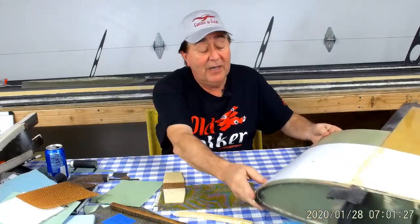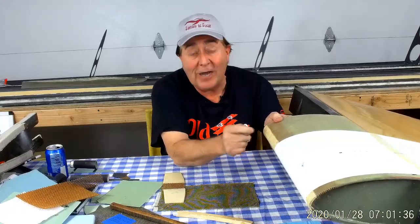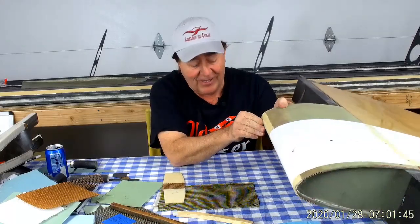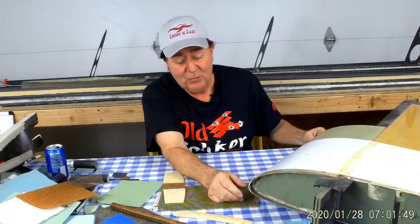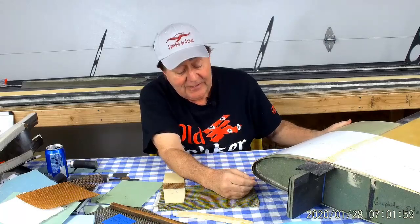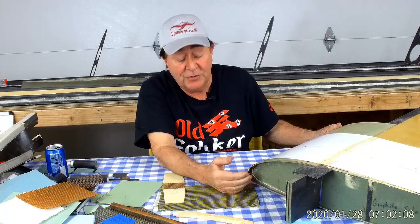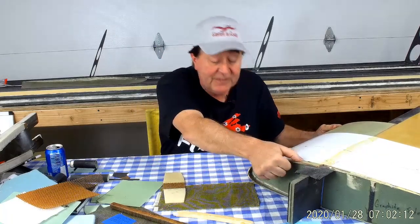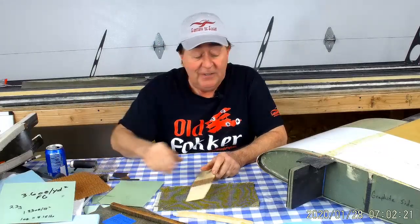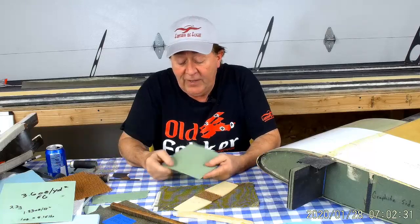It was still dent-sensitive, so in the molding process I filled a section of the honeycomb with micro balloons and epoxy, and you get a rock-solid leading edge — you could probably cut down a cactus flying through it without damaging the wing. Really tough, though a little heavy, because even micro balloons and epoxy add up. The test section I did load testing on was built this way — honeycomb up front, Divinacell in the aft portion, eighth-inch thick. But I got into an ounces-per-square-foot problem; the eighth-inch foam weight adds up over the large D-tube area, so I had to go to a thinner foam.